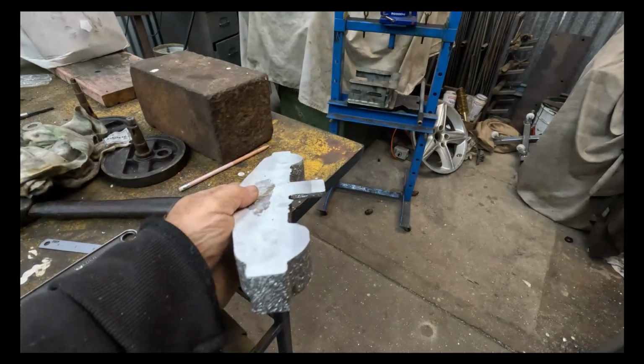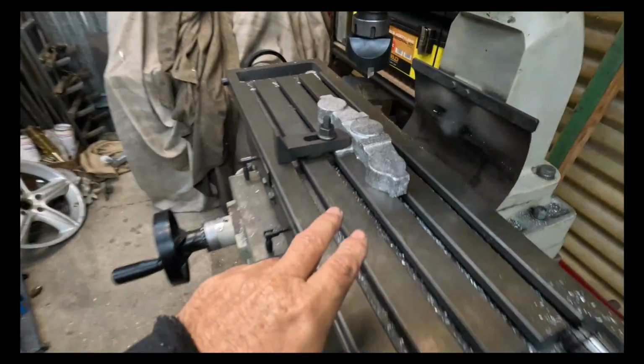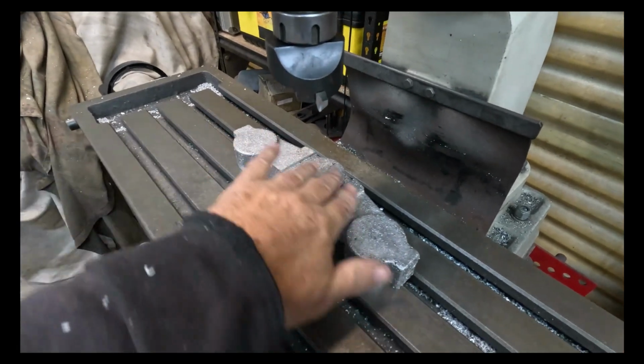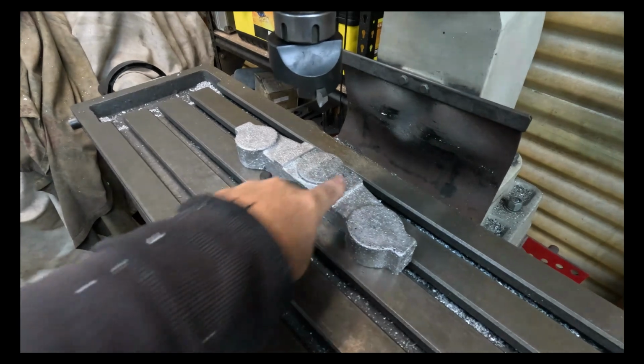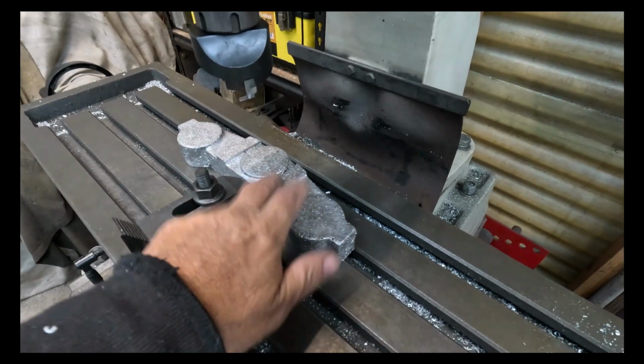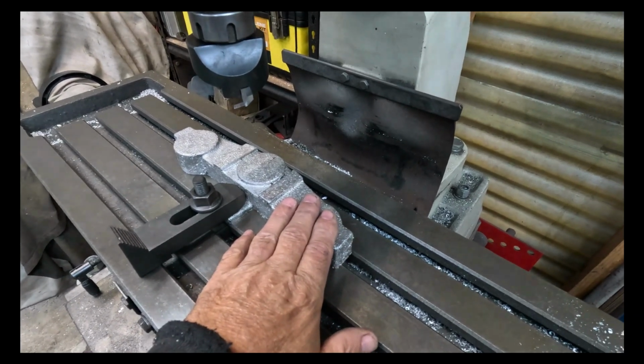In this video, I decided to do a video on machining those triple clamps up and fitting that all up. So let's go and have a look. So I have both of them fly cut underneath, and we've just changed the setup, and we'll just fly cut the tops of these. Just gives it a clean up. This is the top triple clamp. So we've got 1 millimetre to take off there.